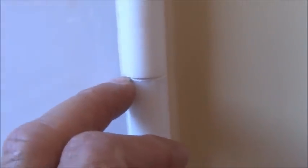This is off by about a sixteenth of an inch, and look at this — this has lippage. There's no reason for that. This is a relatively easy job. Normally marble is what they call rectified, meaning each piece lines up to each other piece, so it's very easy to make this happen better.